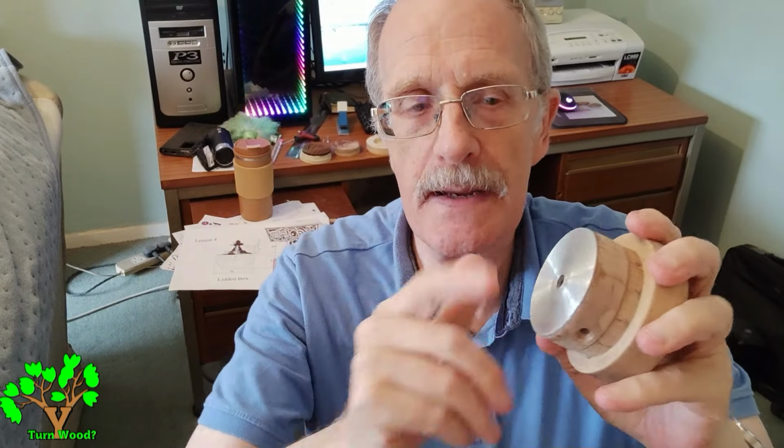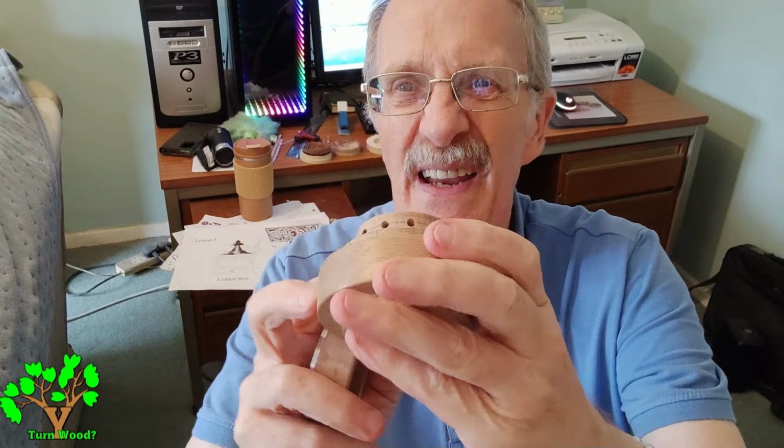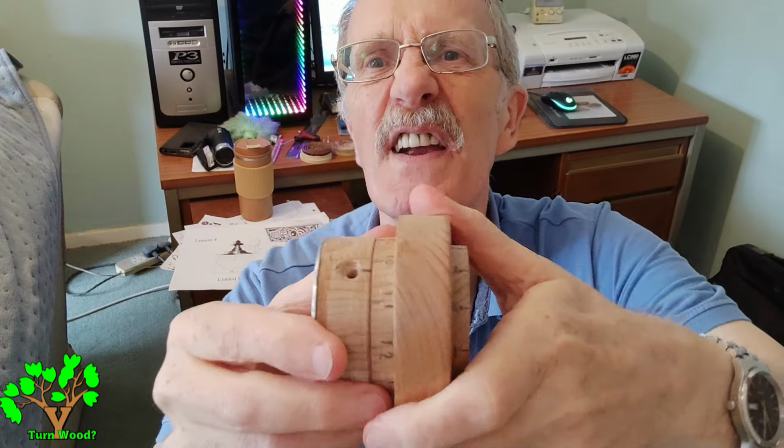My latest escapade is an eccentric jig. This is made out of beech. It has an aluminium frontage where you can stick various things with double-sided tape. You can stick various pieces of wood, offcuts and that sort of thing, and shape them. Well, that'll become apparent in the next video. And it's got an indexing mechanism here, so that there's a reference line on here that can be moved round. I don't know if you can see it there. It can be moved in various positions.